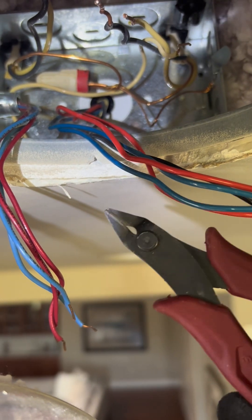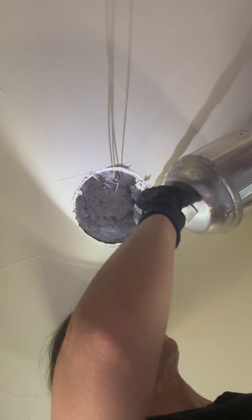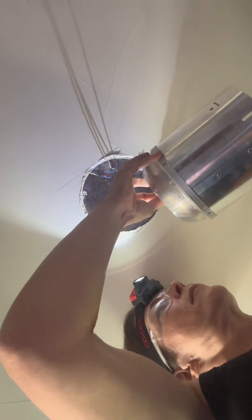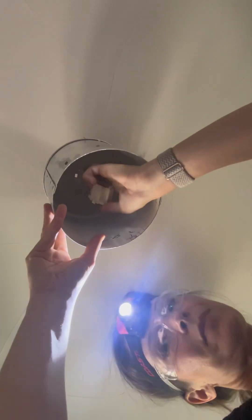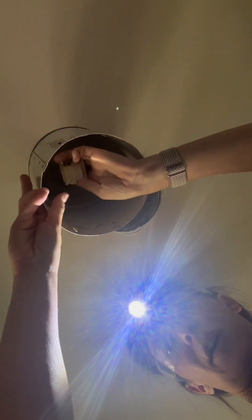These four remaining wires are not trash, so don't cut them quite yet — we will be getting rid of two of them. I'm going to snip the trash wires. The top of my light fixture has the light bulb holder stuck under it, so I have to rip this off — the other ones I've seen don't have this. Don't use gloves for this part. Just rip it off — there are two little clips, you just pinch them. Pull down where the light bulb was and snip off the wires from the top of this block. The four wires are snipped.